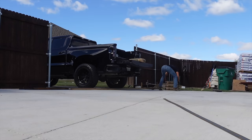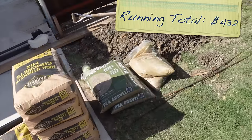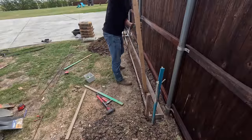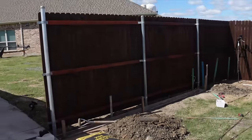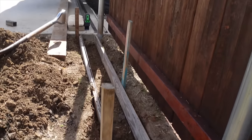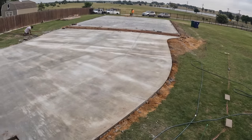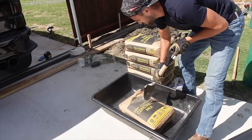After a quick trip to the local Lowe's, we got ourselves six bags of 80-pound concrete and three bags of gravel. We'll throw the gravel down, compact it as good as we can, and then mix up a whole lot of concrete in this little bucket and toss it all in. We've also got our forms — I got killed in the comments on the other video because I was calling them formers. The forms are staked in, and all this lumber is left over from when we did the shop foundation, including some number-three rebar, so we'll have rebar-reinforced concrete for this little footer.